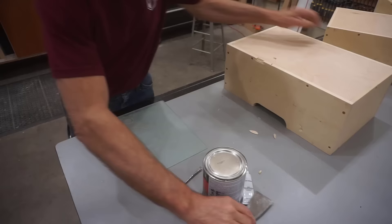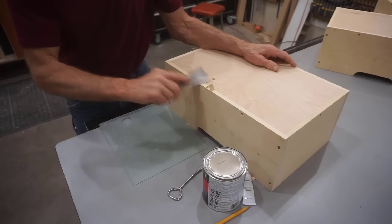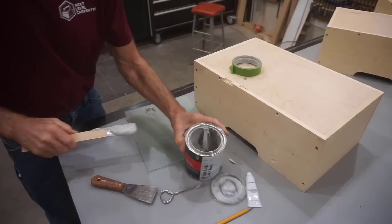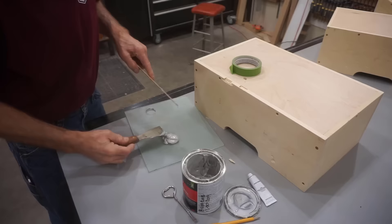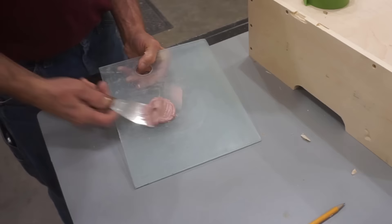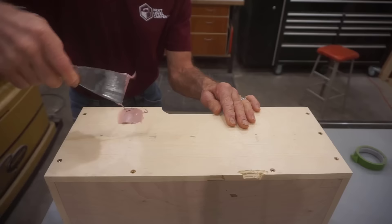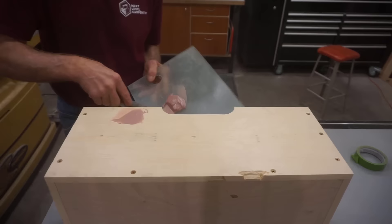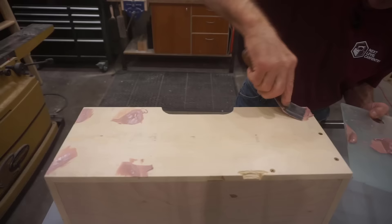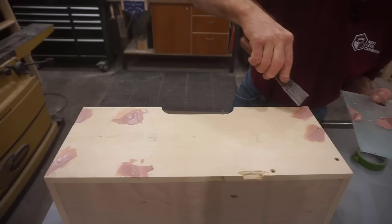I did a whole video on repairing defects in wood before painting, and I'll use basically the same practices here. Make sure to remove any loose material in the patch area so the filler is applied to a sound surface. Then mix up an appropriate amount of auto body filler — I'm using Bondo, but pretty much any brand will work. A good rule of thumb is to use about a one-inch strip of hardener for each golf-ball-size quantity of Bondo, and mix it until you have a uniform streak-free appearance. Working time varies by temperature and humidity, so be prepared to work fast. Push the filler down into irregularities and into screw heads to work out any air bubbles, and make sure everything is overfilled because it's easy to sand off later.